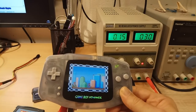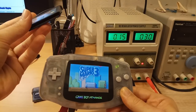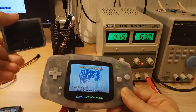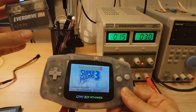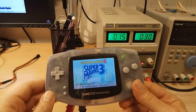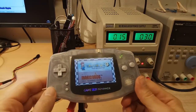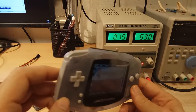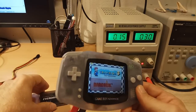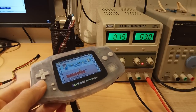Using Eneloops with the standard card, you have approximately 25 hours of gameplay — about two days. Using the Everdrive GBA, you have about 20 hours, which is approximately 20% less. Using the EZ Flash, you have only 13 hours of gameplay, which is half the gameplay time of the standard cartridge. That was a quick comparison of power consumptions between popular flash cards and the standard GBA cartridge. Thank you for watching and see you next time.